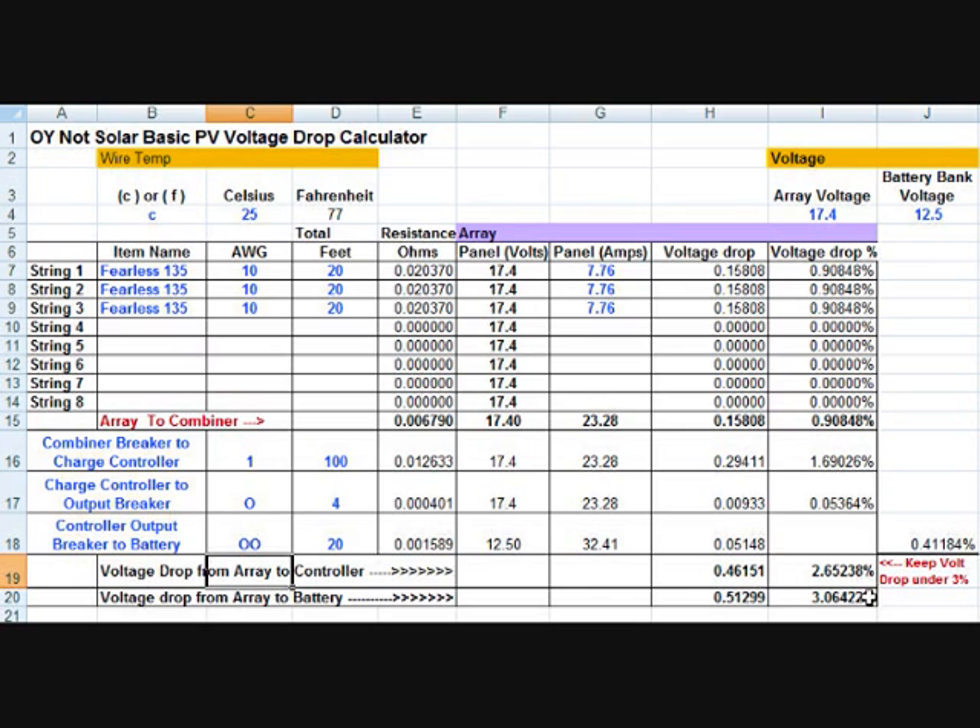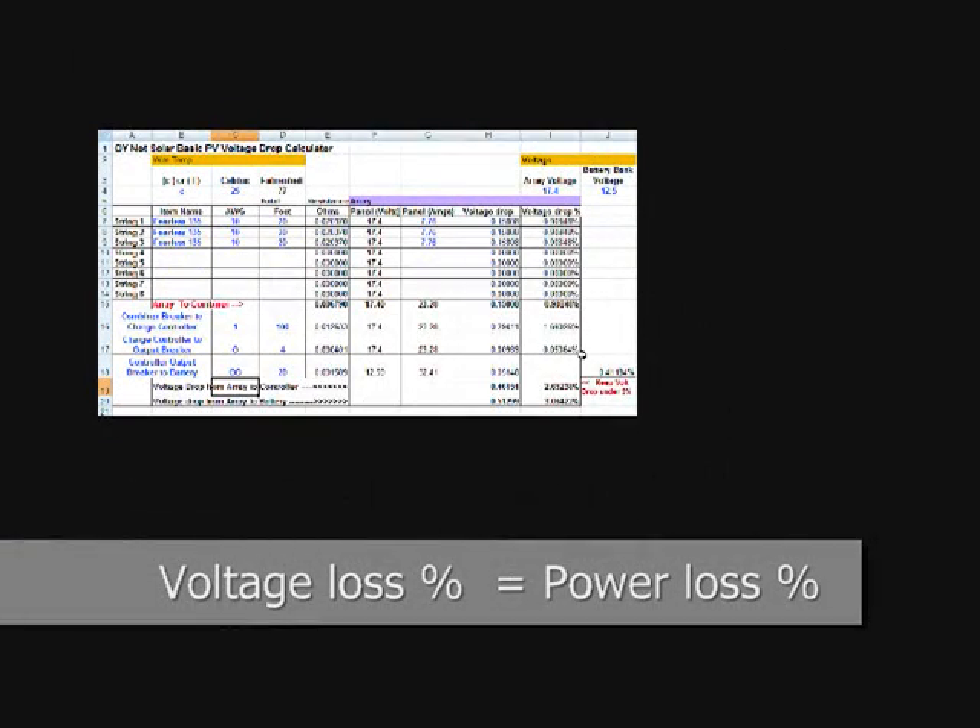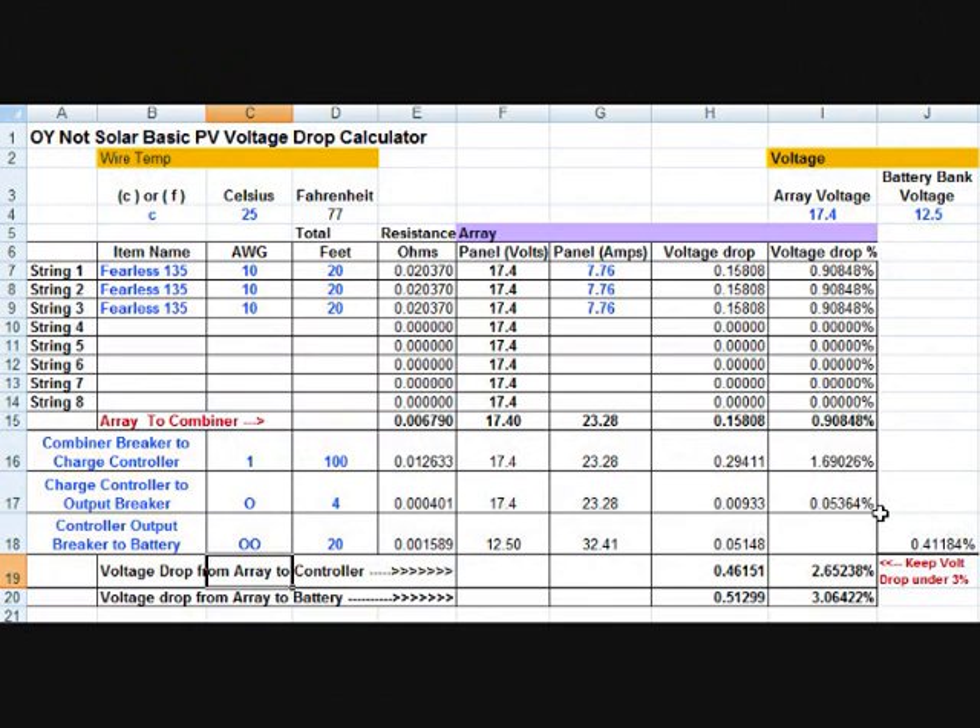You can carry this further — if you're running to a charge controller, then through a breaker to your batteries, you can factor in even heavier gauge wire, including 0 gauge, 00 double-aught, and 000 triple-aught wires to get total losses as low as you can afford. This tool allows you to play around with wire gauges and distances to have your total drop as low as you want. For a PV system the target is 3% to have a commissioned system, but you can make your own decision based on cost. These tools are easy to use and will help you decide whether to run wires from each panel back to individual grid tie inverters, use one grid tie, or have combiner boxes along the way.